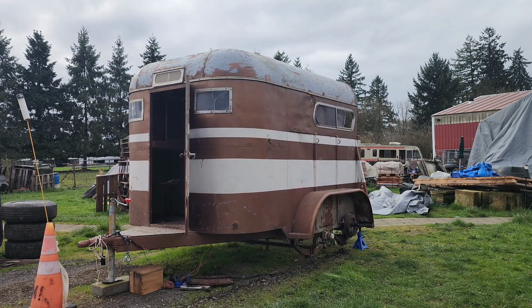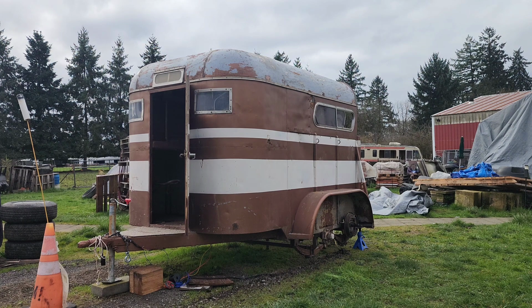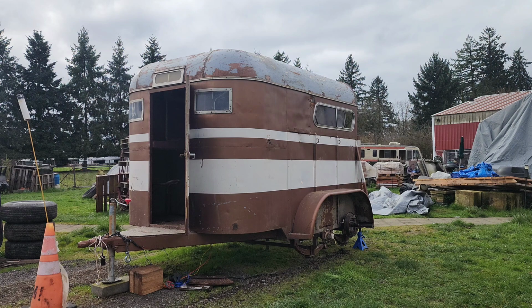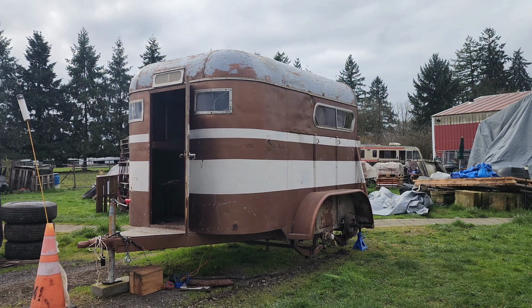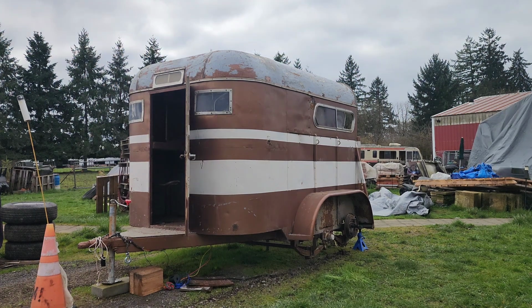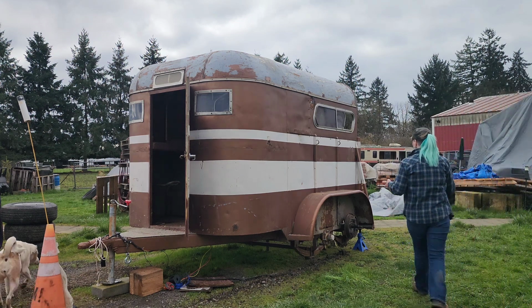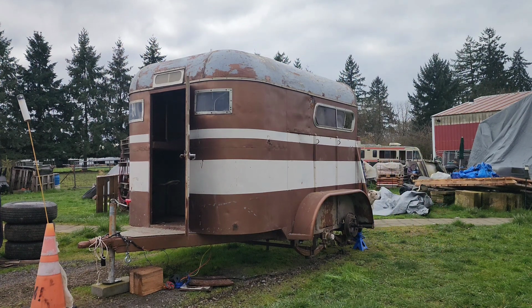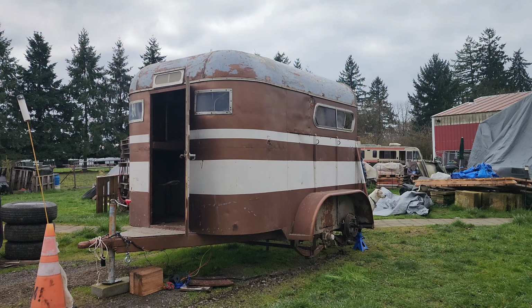What I really want to work on is over here, and I want to get some of the roof anchored in good with the new metal screws. I just put the load locks in to support the roof while I'm up there. While the weather's still holding, I want to pressure wash the rest of the stripped off portions so that I can start putting some seals on it. So that you can hear me while I'm up there, because I can't take this up there with me. And then grab my little drill, because it's easier for me to hang on to, and see about putting some screws in the support. It looks like they've fallen out.